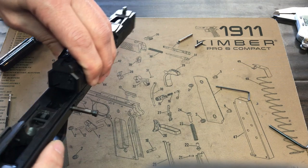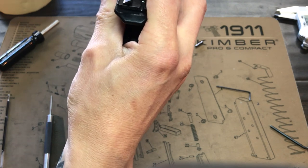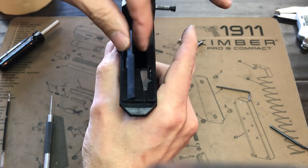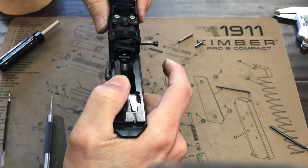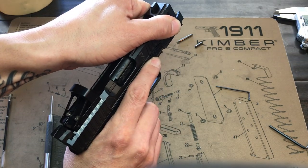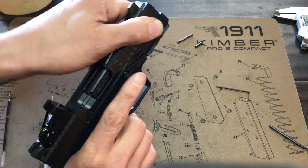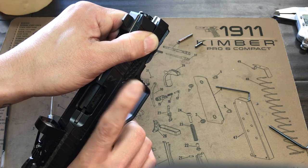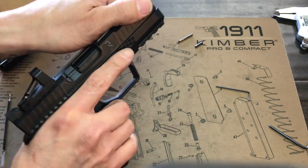I'm not going to put the pins in yet — I'll put this together and do a function check first, otherwise I'd have to take the pins all the way back out. Sometimes when putting the gun back together things feel stuck; the slide wiggles just a hair, and you push down with your thumb to meet that channel. Pull back just a little bit — about three eighths of an inch — then push the takedown pin in and it's always fine. We'll do a function check now.